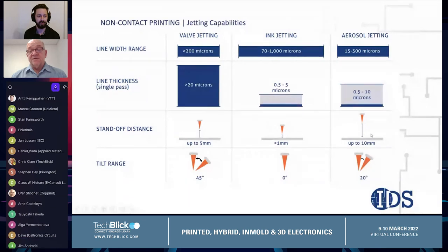The distance between the nozzle and the print substrate is up to 10 millimeters. The aerosol printing technology is highly collimated, so the aerosol stream doesn't diverge much over this range, giving a very uniform print width as the surface topography changes. We've also demonstrated printing with the head tilted up to about 20 degrees. All of these attributes make aerosol printing very useful for printing fine features onto non-planar or 3D surfaces.